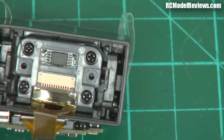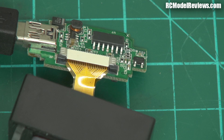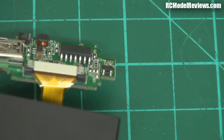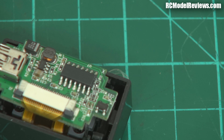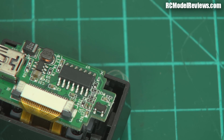I've got my multimeter out. It's a very stiff lead they're using on this thing — not very flexible, which might be a bit of a hassle if you've got it hanging off your glasses because it's going to put extra strain on those little rubber bungs. The first thing to test: I'm going to check the outside of the USB connector — it should be negative — and check the leads that come off the JST connector.